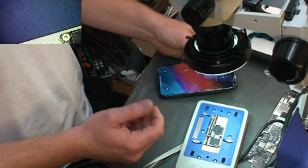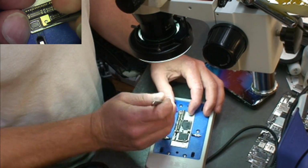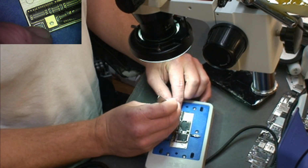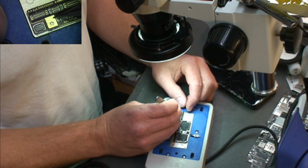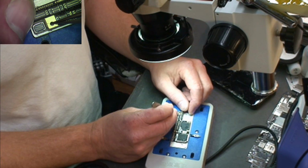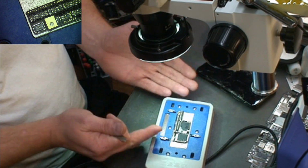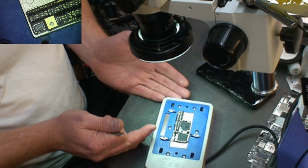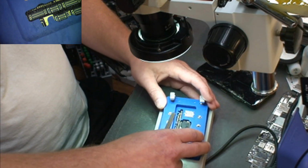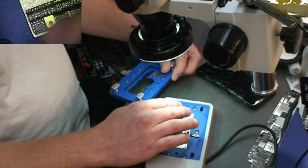And so I had to take the board back out, and I had to manually align the boards, like you can see through my scope right now. With it setting on these alignment tabs, the board could be, you know, that far off. So in order to alleviate the boot looping, I would have to manually align the board, make sure everything looked good, turn the board heater on, let the balls set like that where I had it aligned, turn the heater back off, let it cool back down, and then I would put this top spring-loaded bracket on that would press the board down evenly.